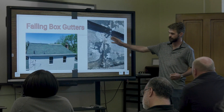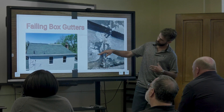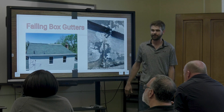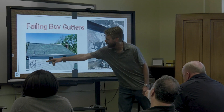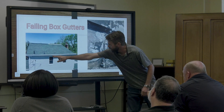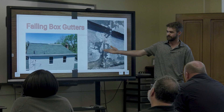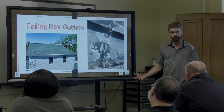Here we go with failing seams. I was on the neighbor's roof, glanced over, and saw a big smiley face — a happy day. But it's not right. You've got a downspout over here and it wraps around the corner, there's a downspout over there, but you can see water lines coming through because it's sagging in the middle — and that's a big indication that you need new liners.